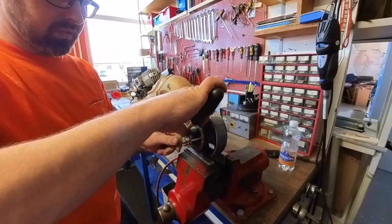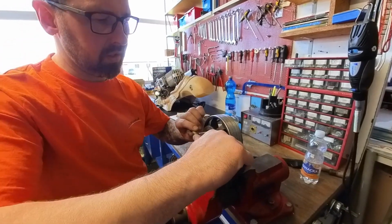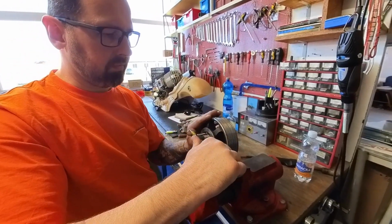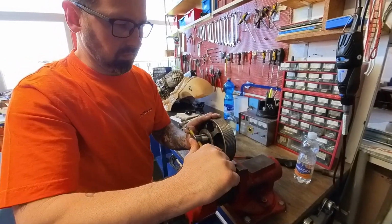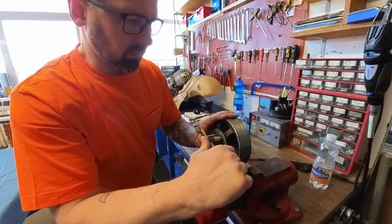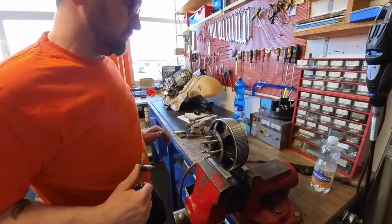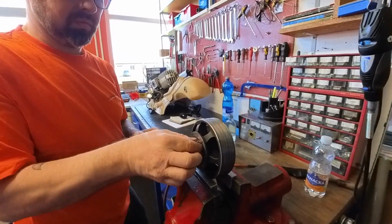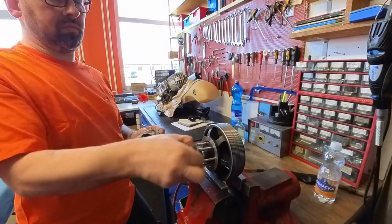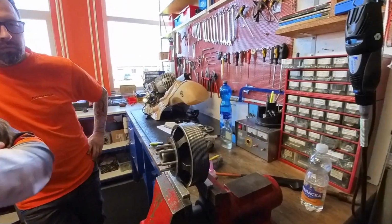You don't have to over torque it. It is the Loctite that holds it in place. I use two hands, but it's the glue doing the job. I'm always nervous of over tightening because then it becomes more difficult to get out, even if you heat it up. But if you don't use enough torque, it may protrude too far, and that is when you get damage on the prop.